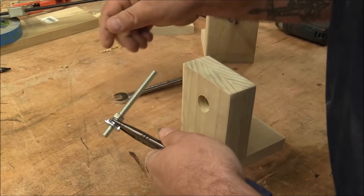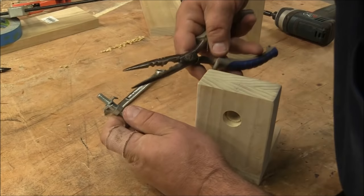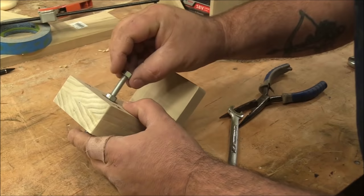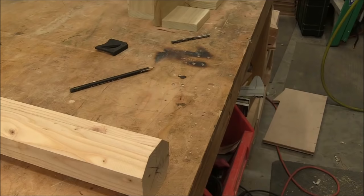This is going to be the head stock, so I'm going to thread a nut on and then use a T-nut and jam-nut those two together again, leaving about five-eighths of an inch sticking out. After that's done I'm going to take a pair of pliers and turn the tangs over so they face forward, then thread it through and repeat the process — tighten a nut down on the bolt until I feel some resistance and there's no play, then tighten another nut on top of that and jam-nut those two together to keep everything nice and secure.